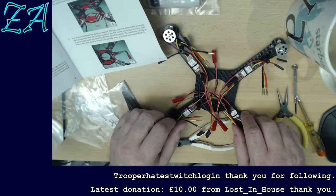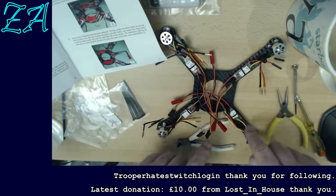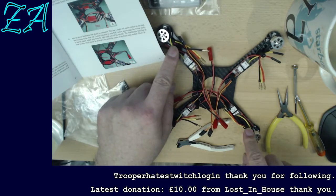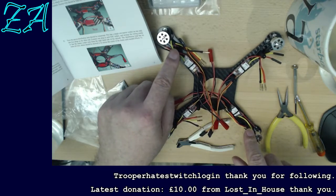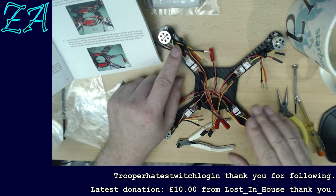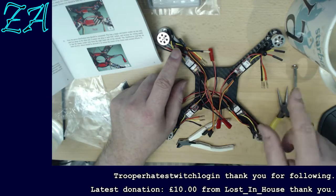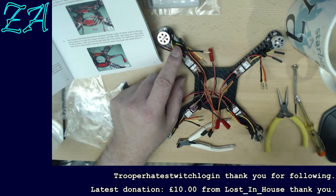And so the clockwise ones I wire up as per colour, red, yellow and black. The anti-clockwise, I just swap any two colours, which is interesting. I've been on quite a few forums where beginners have posted about cars, boats, quadcopters, helicopters, saying it's going the wrong way, the motor's rotating the wrong way, and when they get the response, just swap any two wires.